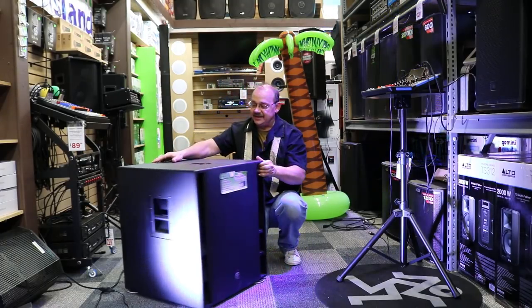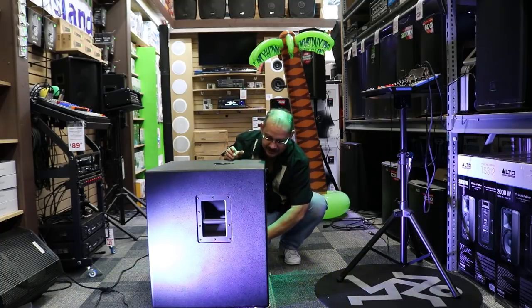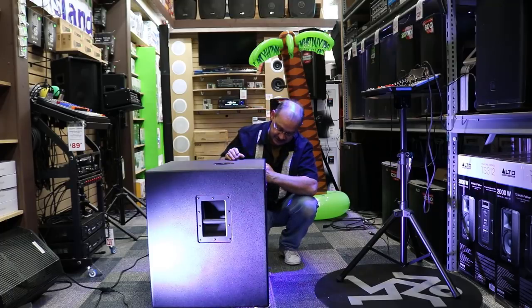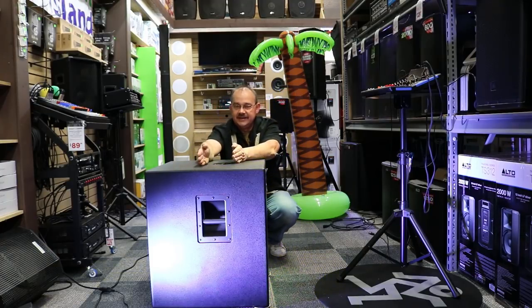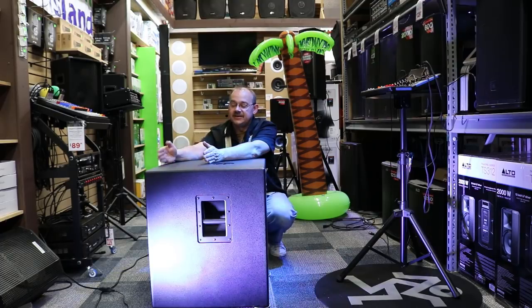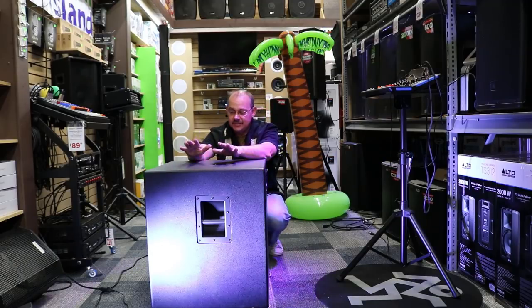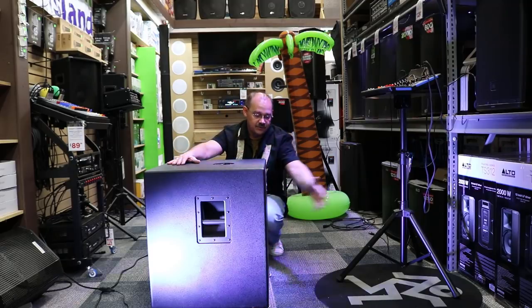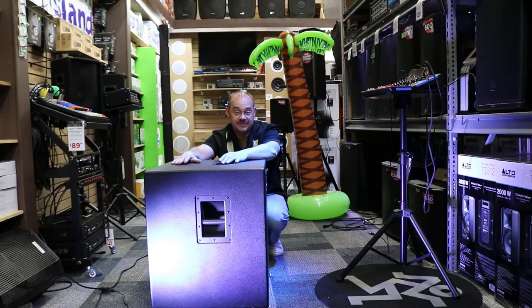Inside this box, as I stick my hand in right here, working our way down to the actual speaker which is roughly halfway in — you can touch the magnet on the backside. The back of the speaker is connected there, which leaves the front space as a sealed cavity that generates all the bass. It also extends cavity-wise all the way back up. Normally a forward-firing speaker throws about 50% bass forward and 50% into the box. A bandpass design is more like 75% coming out of the box and 25% out of the port, which is why it works in so many more scenarios.